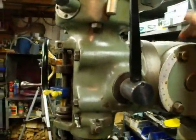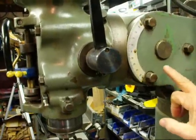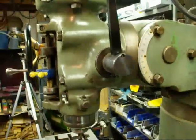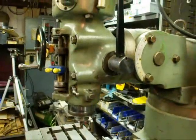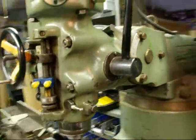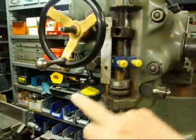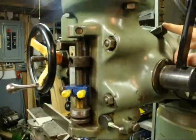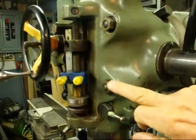We can tilt the head in two directions. By loosening these three bolts — one, two, three — and then turning this bolt or screw, that allows the head to tilt about 45 degrees down or up. I call that nodding the head, though I like to keep that on zero. We're also able to tilt the head from side to side by loosening four bolts and turning this screw — there's a worm in there, so it won't fall down on you unless your worm is broken. When making those movements, only loosen the bolts about a quarter turn.